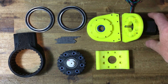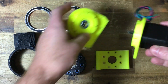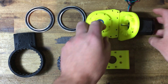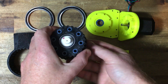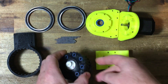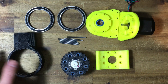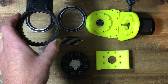The main parts are a NEMA 17 stepper motor, an input housing in yellow, an eccentric cam in white together with 3 cycloidal gears in black with all their bearings, also the pins to convert the eccentric motion to the output rotation, the joint bearings, and the output housing. The output housing design is similar to the one being created by Tim Wilkinson.